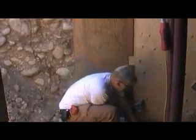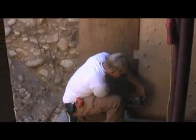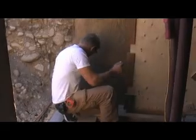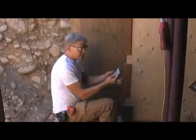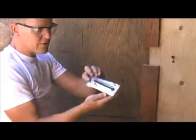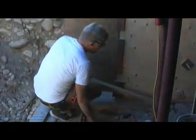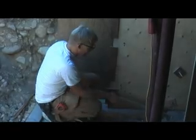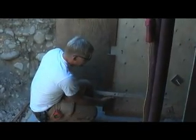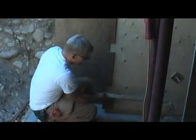If you're using these conical ties, which we're talking about, you don't need these. You do need these. These are kind of the same thing. They're tapered wedges designed for conical ties. I've already pre-drilled this 2x4. 2x4s are one way to do it. They have steel reinforcement, which you can use as well, but these are designed for 2x4s.